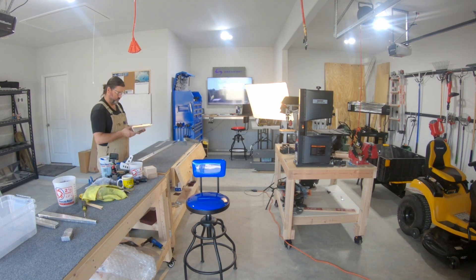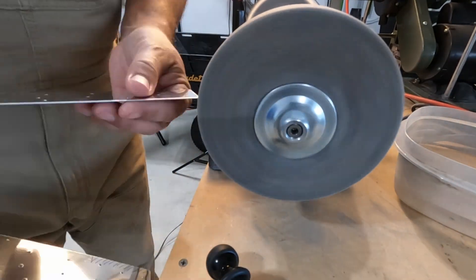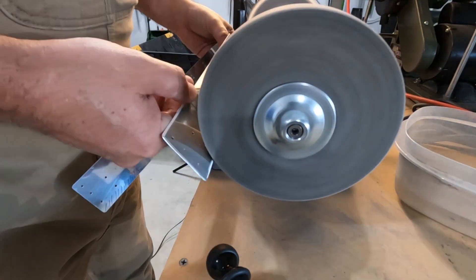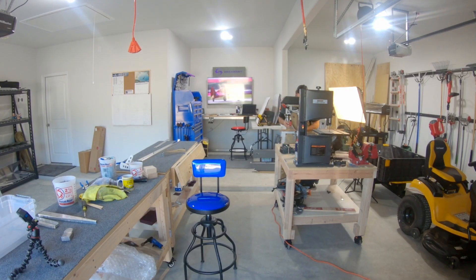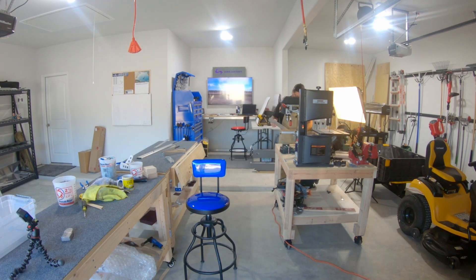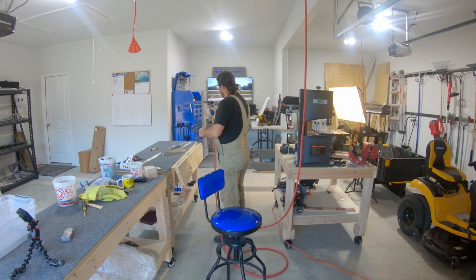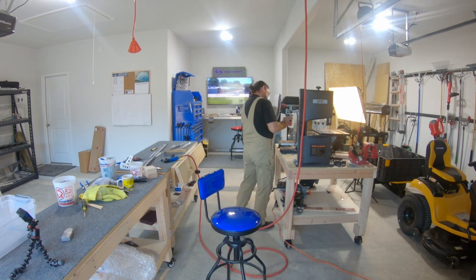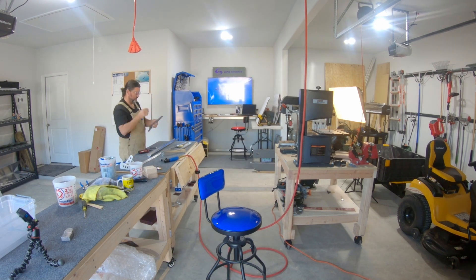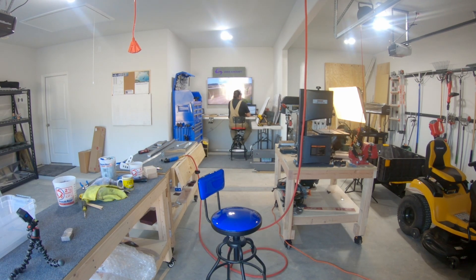At the end of the table you see the counterweight attach strap skin — that's what I'm working on here. You end up with three layers thick between the skins, the counterweight attach skin, and the fiberglass itself. So you need to bevel the corner of that to create a smooth transition. Once that was done, I start working on edge finishing and deburring the rest of the skeleton parts. I have a die grinder with a scotch brite wheel to get into smaller spaces.